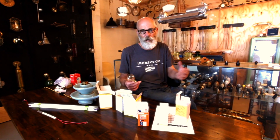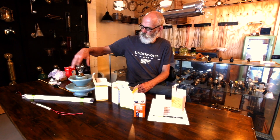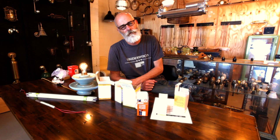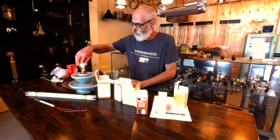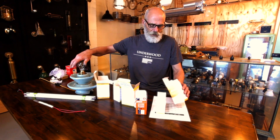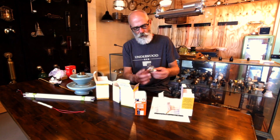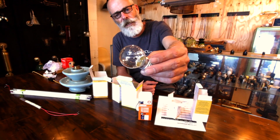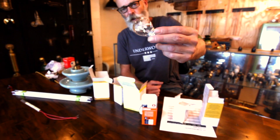It creates a lot of heat. It's got a vacuum inside, so when they break they explode into a million bits and they're not very efficient. This is a 25 watt globe and it creates just an ambient type of light — not a great deal at all. That was common for old-fashioned globes until they created the tungsten filament, which is a more modern, very small filament, but again in a vacuum — just a hot wire with a voltage going through it.